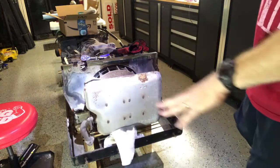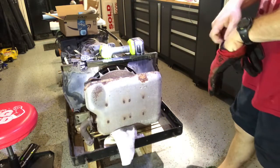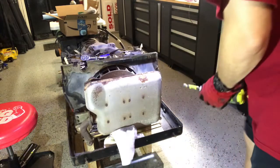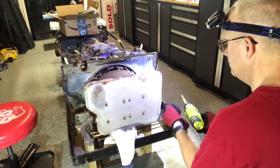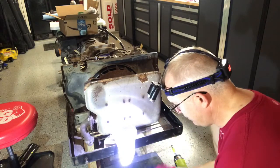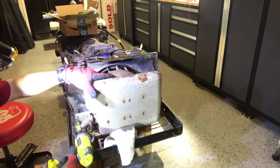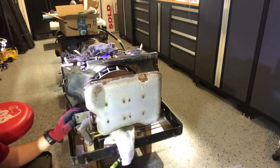We're set back up here and we're going to go ahead and take this muffler off on the front, then start pulling the flywheel so we can get that off and then get this front shroud off. Originally I had tried to avoid taking this off, but it doesn't look like I'm going to be able to avoid it. In case you're wondering what I have this on — I made this from a furniture dolly and a 2x12 cut to make a platform for this machine, so I can move it around and turn it without too much effort.